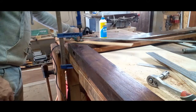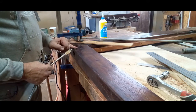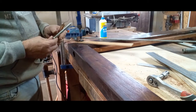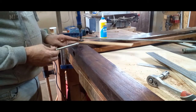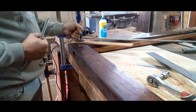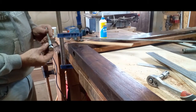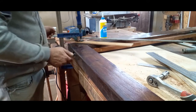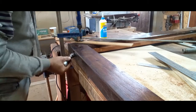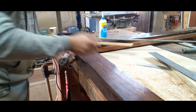What I didn't record: I then take a slightly thicker bit for just the first part and widen the hole to a thickness so that I don't want the thread to grab on this part — I just want the thread to grab on the back part and then pull it together. I put a washer on it and we're going to turn it in, using the socket wrench to tighten it down.